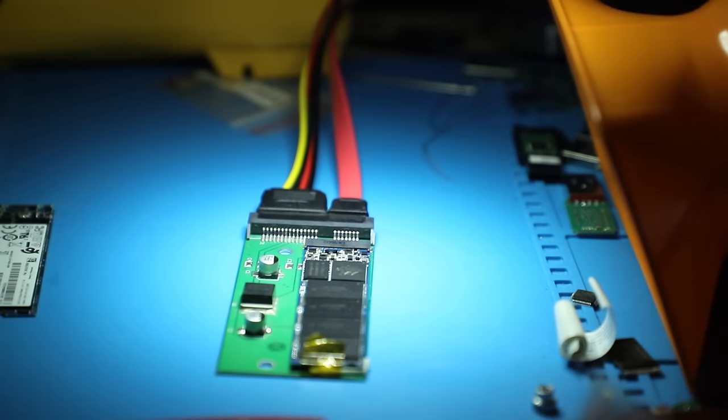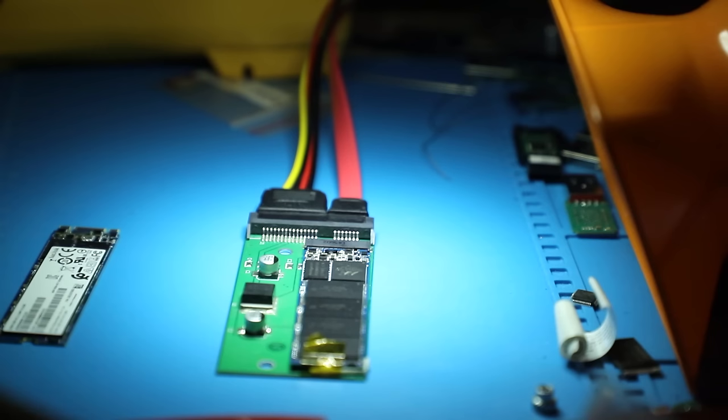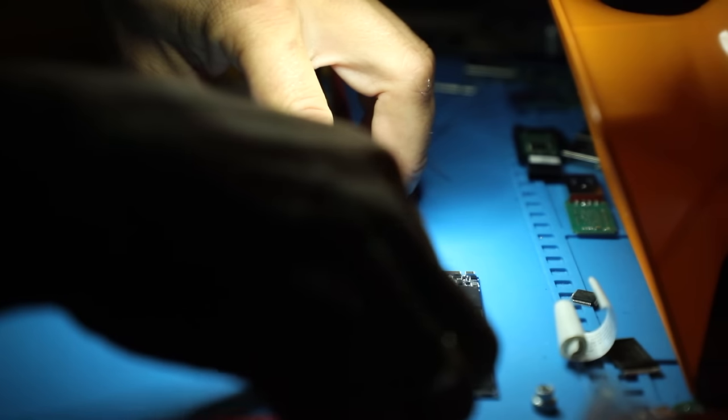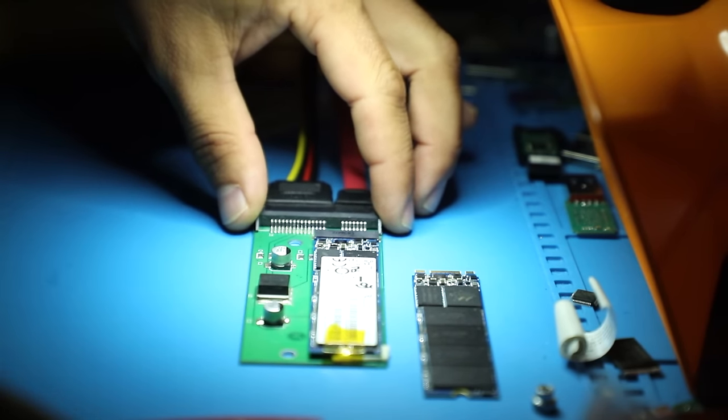So right now I have this connected for demonstration purposes, and if I switch over to my screen capture, power on the device, we see all registries here light up like a Christmas tree with a little bit of a dim look to it. In some cases it will mean that there is a short somewhere. In some cases it will mean that the controller may be dead. That's exactly the reason why I got the donor. So if we turn off power on it and disconnect it, connect this one here, this is our test unit.